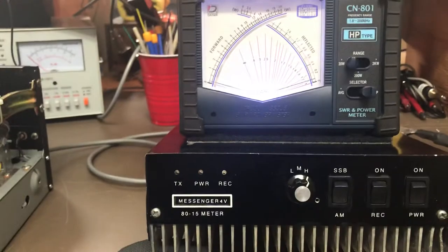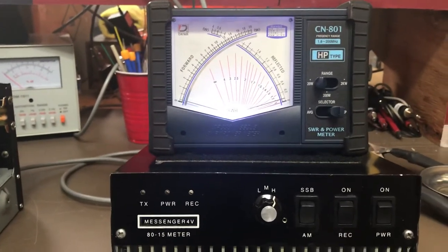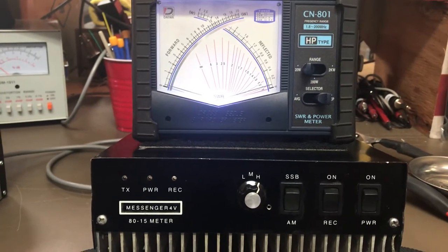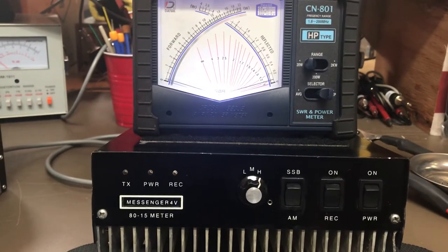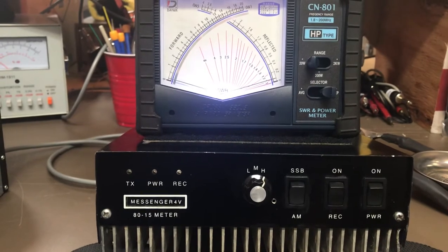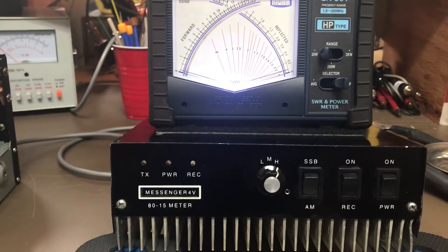You'll see the pictures on the back - there were some modifications. They took the fuse out of it; the fuse is kind of cheesy anyway for what amperage it's pulling. It should be rated for 100 amps and I don't think that fuse holder is, so they pulled it out. You'll also see in the picture there are two power lines going in, they put two grounds in, and that ground strap was put in there. The two separate grounds help get the flow of current through the transistors.